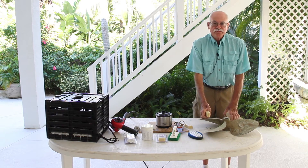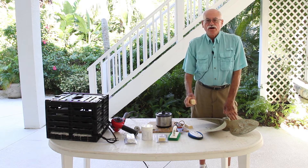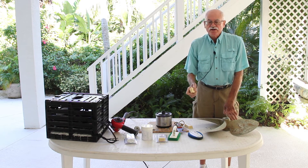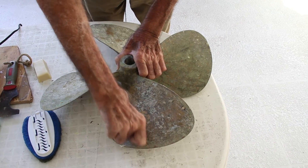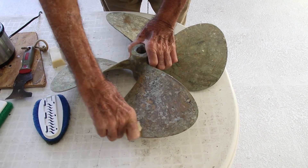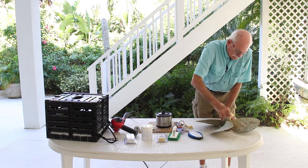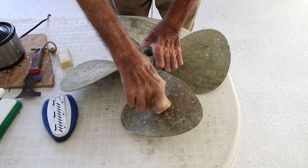We've got our surface clean now. If we were working underwater, of course we would have gloves on. I recommend you wear latex or rubber gloves any time you're working with Barnacle Stop, and do not touch your eyes. The Barnacle Stop bar can be used just like a crayon — you take it and coat the surface. When you're underwater, this is a little more obvious than out of the water. You coat the surface like a crayon and go completely around the propeller, making sure you get the hub, then flip it over.